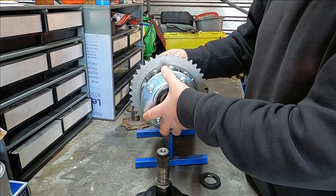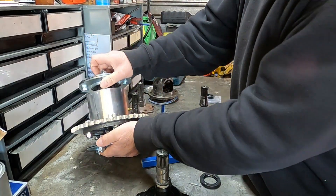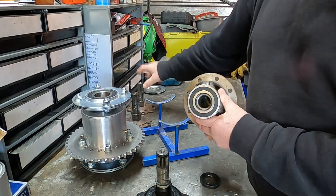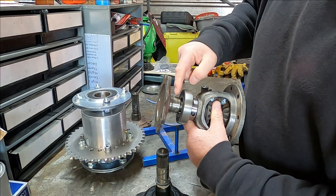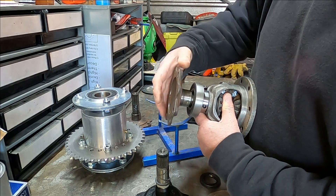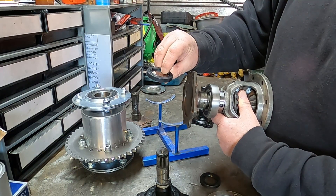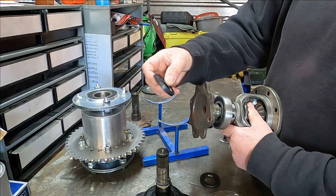It will work on both types of differentials. This is the larger one - the 7-inch version. Then there was also the 6-inch version, which uses a similar housed bearing. There's a recess in there and the output shafts push in and the seal journal sits back out here, so a little extended oil seal carrier pushed in will do the job. Both use the same 35mm seal - 35mm inner diameter, 52mm outside diameter by 8mm. Fairly cheap, about 3 pounds each.